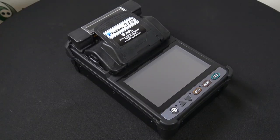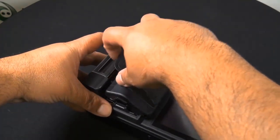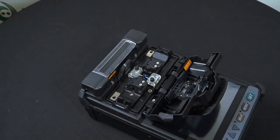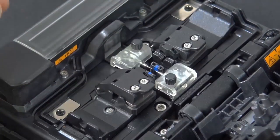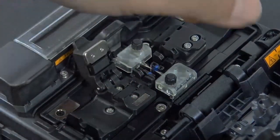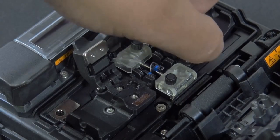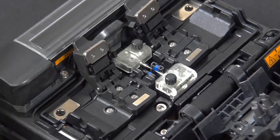Let's go ahead and check out the 31S. Open it up so you can get a good look at what's going on in there. The electrodes will last up to 5,000 splices. And with the Phillips screwdriver, as you can tell right there, you can go ahead and unscrew those and put the proper fiber holders in place.